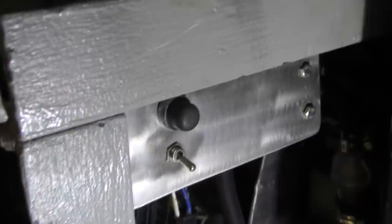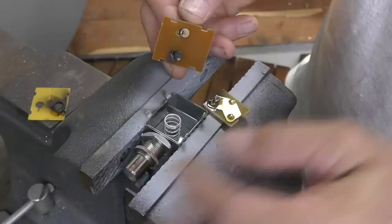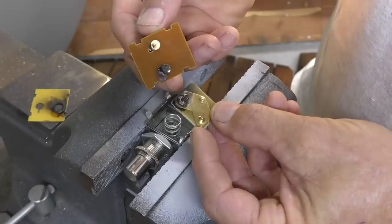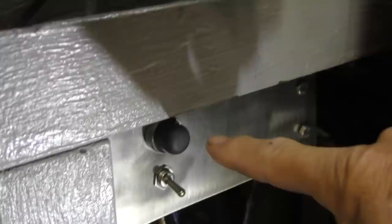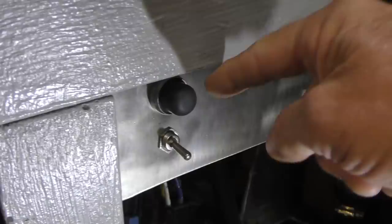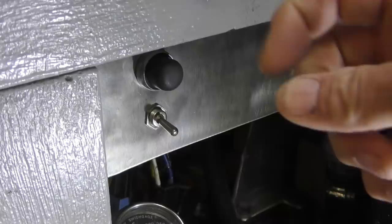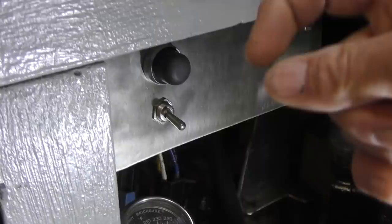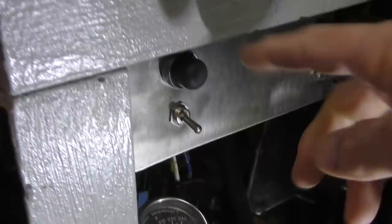Both are now 24 volt, but even at 12 volt they would have been doing damage to these switches. The first switch that bit the dust was this start button - there's definitely some fire been in there. This one, when you push it, fires both the fuel solenoid and the starter solenoid contactor. When you let go, those two coils de-energize and send a lot of voltage back through - maybe a hundred, maybe two hundred volts. Not a lot of amperage but a lot of voltage, and voltage is what's needed to jump an air gap. That arc burns the contacts as they're moving apart and welds them together - it actually melts them.